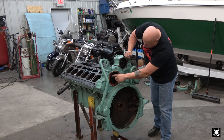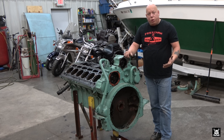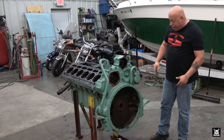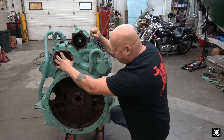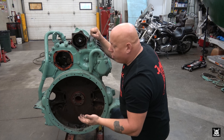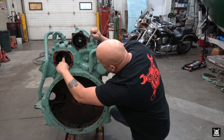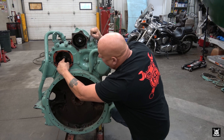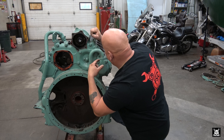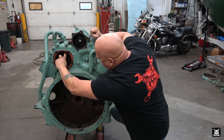We did work on the front - I did take this apart trying to figure out how to get the front end of the cam off. According to the book, these cams can be changed without having to take the back of the whole truck apart. However, you do have to get this gear pushed off of the cam. This is the cam itself - the shaft - and this is the gear. There's a counterweight on one of them on the other side. There is a plate that grabs this gear and hooks it to the cam.